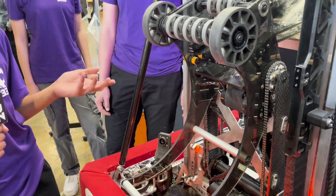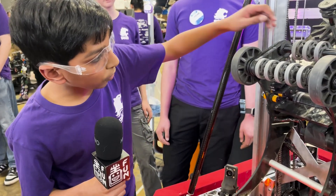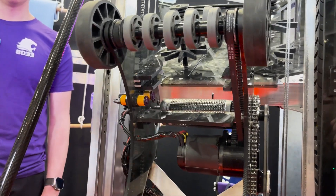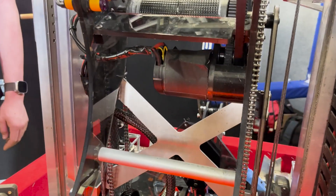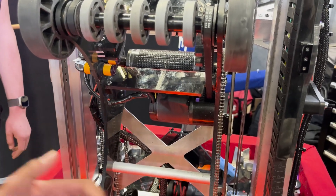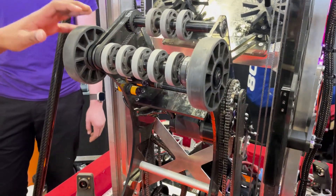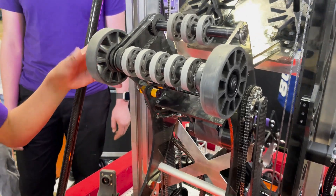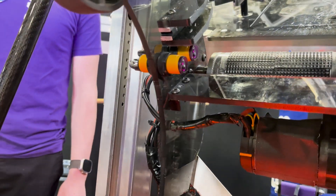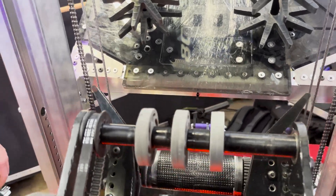For compression, we had a lot of inspiration from the WCP competitive concept, which had an end effector somewhat similar to this. For coral, we have two sets of compliant wheels up here as well as a silicone roller with some grip tape at the back. This is all powered by a single Kraken X60, and everything is rigged together through gears, pulleys, and belts. There's a plate which serves as support for the coral and also makes the end effector more rigid. The wheels on the other side manipulate the algae and place them on the reef. We also have beam breaks and a centering mechanism to ensure the piece is ready to go on the reef as soon as it exits the funnel.